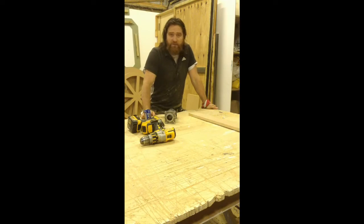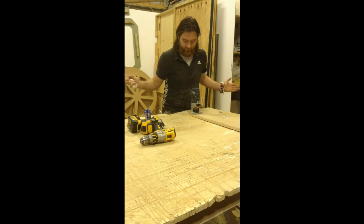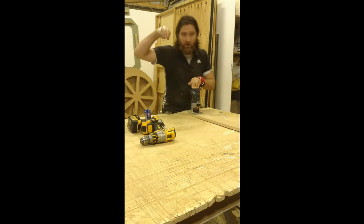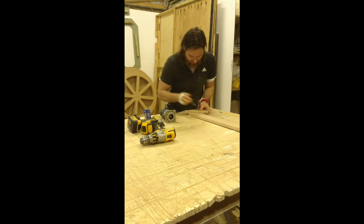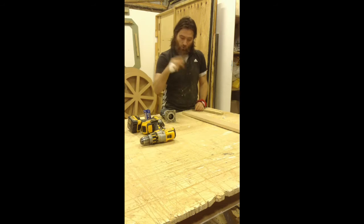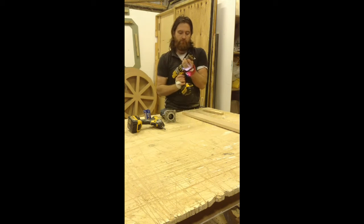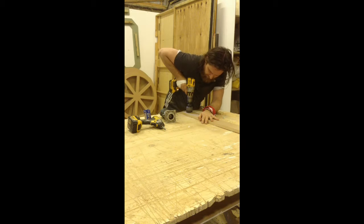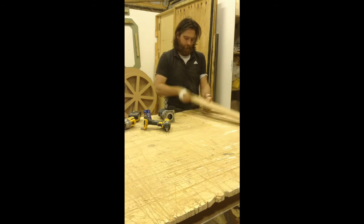Now's the time to cut the clearance on the compass cutter for your router. This has been cut at the same width as the router plate, as we can see — smooth on both edges. Line the edge of the router plate up with the end of the compass cutter and draw a line where the plate ends. With a straight piece of material, draw across just like so. The middle of that cross indicates where you need to drill a hole — this will allow your router bit to go through the compass cutter plate. With your combi drill, insert your hole cutter and cut your hole. There we have it.